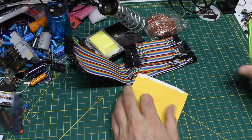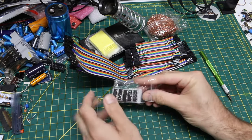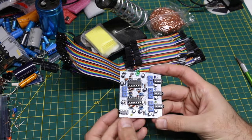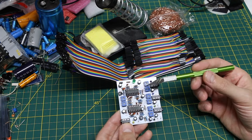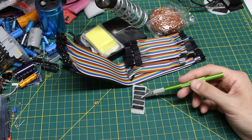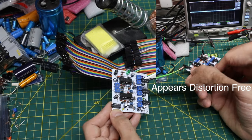This should be op-amps — it's some kind of chip. Sometimes you can see the tracking number on the package and other times there's five or six layers of labeling and you no longer have any way to tell what's in it. TLC274CN — those are the quad op-amps I recently used on this audio distribution board with stereo in and three copies of the stereo out. I was starting out trying to use an LM324 but with crossover distortion the audio signal was not coming out the way it was going in. So the TLC274 worked well for this purpose, and of course I don't know if these are legitimate, but I can drop one on this board and see if I'm getting signal integrity compared to that crossover distortion.